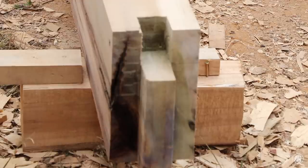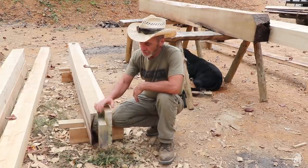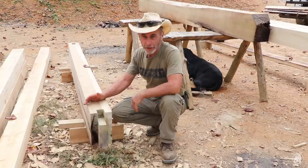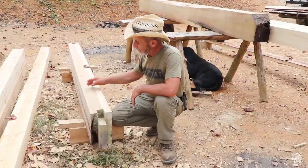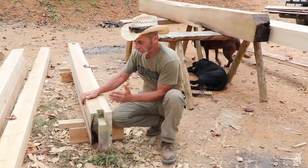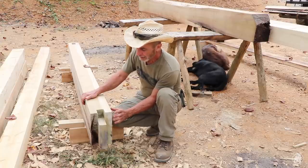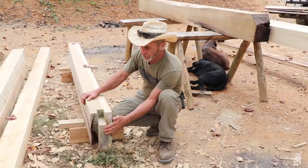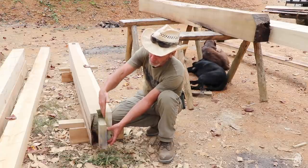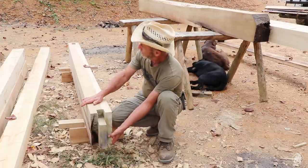This funny-looking timber with the tenon sticking out and part of a mortise — this is where the floor joist will come in at the wood shop. I could be a purist and notch all down through here where the floor joists go, but I decided to use a sill plate on the bottom instead. It works just as well; it gives the floor joists something to rest on. I'll also get hangers and double up on everything. The tenon is so I can join the next beam to it with a couple of pins, and one of the six by six posts will come down and mortise into the corner, held in place with a pin.